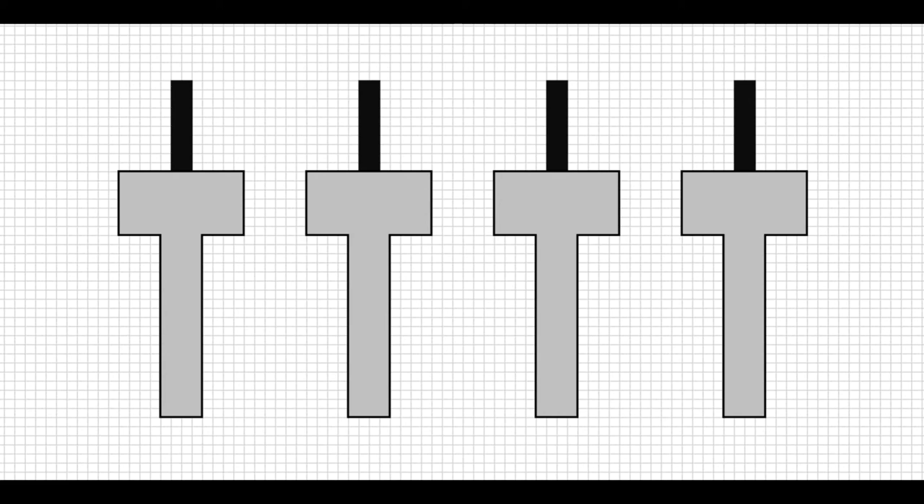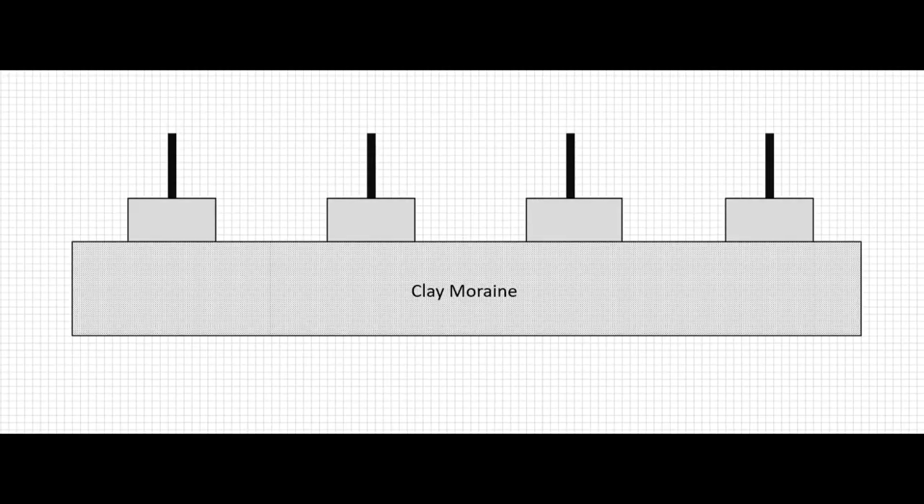As the workshop will have a steel frame, these steel tubes will sit vertically on the concrete foundations. I could see no reason why I needed to pour concrete that was not going to be near the point of contact with the steel legs, hence the use of small slabs or segmented trenches. These foundations will, in turn, sit on the clay subsoil that's been there for, like, ever.